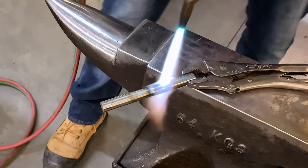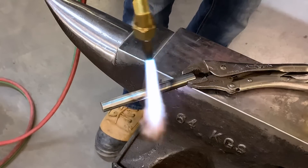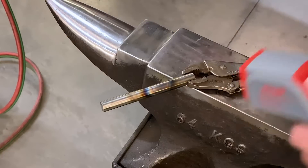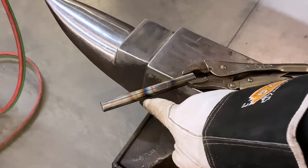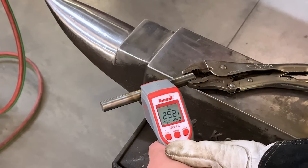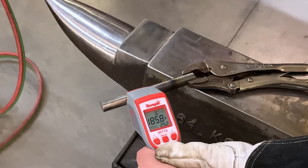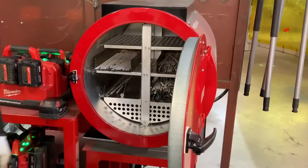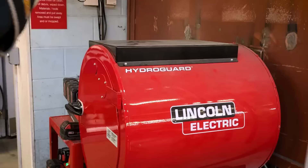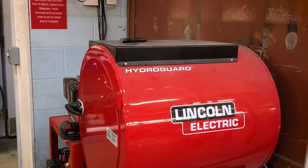In this example I'm going to depend more on the colors from the steel for the tempering process. Here you can see me gently adding just enough heat to have my steel turn purple about halfway up the piece. I then watch for the tan or yellow color to grow into the end. When it's time to cool your material, it can be done in a few ways depending on the application. For this chisel, I like to let it cool in normal conditions at room temperature. Or if I want something a little softer, I can have it cool slowly in the oven or on top of the oven. Most of the time, letting it cool in still air is enough — this is called normalizing.